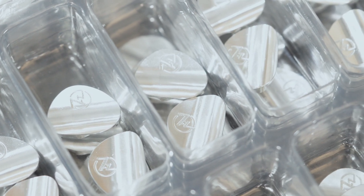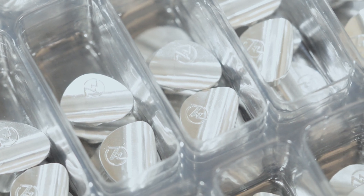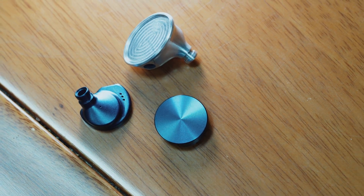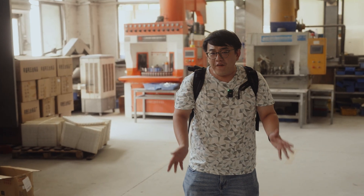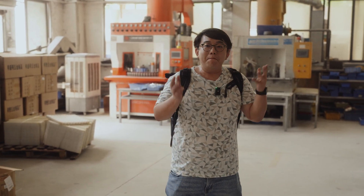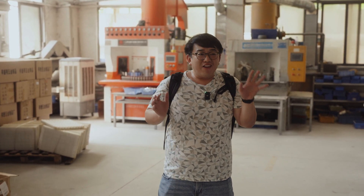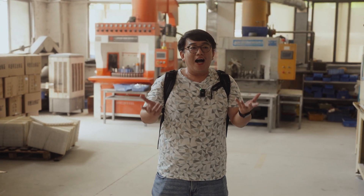7Hz machines a lot of their IEM chassis — we also see the Timeless and Taku here. When making an earphone, one of the most important steps is to anodize your metal fittings. Aluminium is a common material and one that you can anodize. Aluminium is a rather soft metal — if you've handled anything aluminium, it gets scratched up pretty easily. So you need to add a layer of anodization to harden it. We are now at the anodization factory to see the Sonar's faceplate getting anodized.